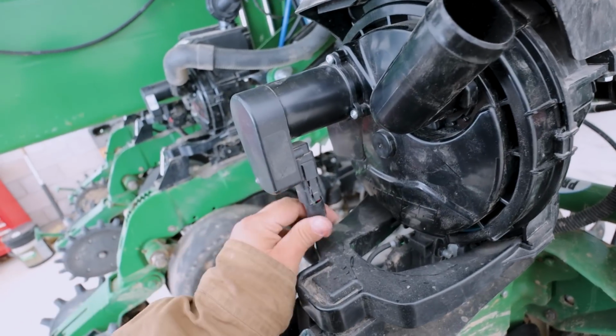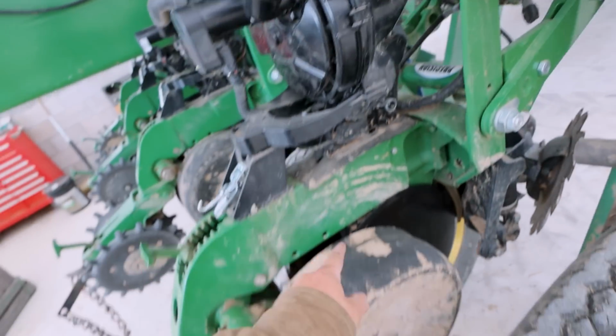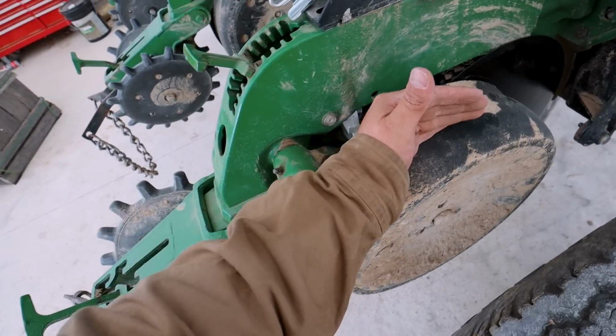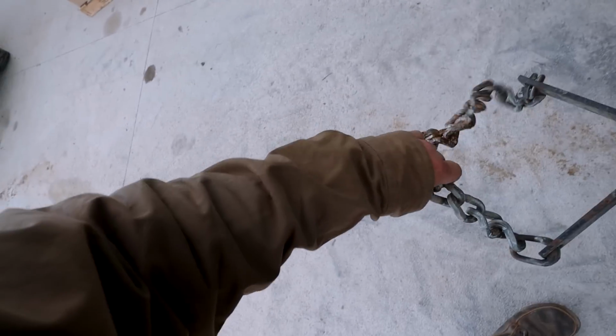Up the electric to our unit. That's what drives that plate, which singulates the seed, sends it to this belt, down through this trench that these blades are creating. It's being controlled by the depth of the gauge wheel. These close the trench. These just make it look pretty.